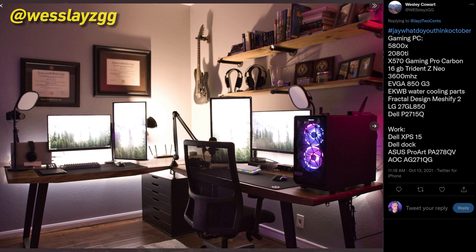And you can make these types of floating shelves yourself, by the way. You can just go into Home Depot, ask for the galvanized pipe and the mount for it, which is designed to mount into any wall. This is just regular masonry type stuff. And you can, as you see, mount it into studs, put a nice little cap on there, paint it, distress it, do whatever you want to it, and then just put a piece of wood along it. As long as the wood's not warped, it'll lay flat, or you can put a lot of weight like books on it.